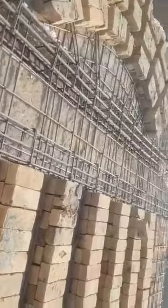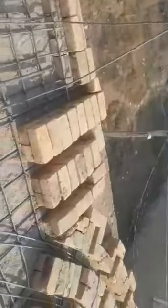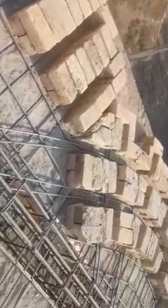You can see the beams and the bricks, and these bricks will be removed after the concreting is done. After 14 days, when the concrete and the slab gets its strength, these bricks are removed and the hollow aesthetics will be formed. From the downside you can see the aesthetics of that structure.